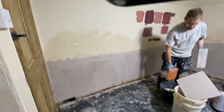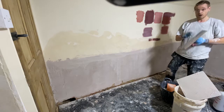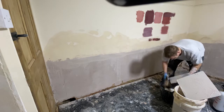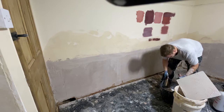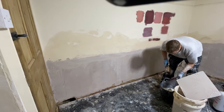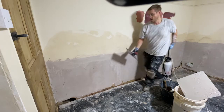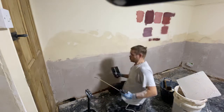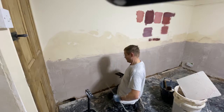Lots of water, but this sponge will fill up with the sand, so you've got to keep scraping off on the side of the bucket. Now, clean the float in the bucket, brush the nice clean float, and then a bit of water, and this will come up nice, clean, smooth, finished surface.